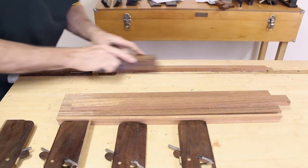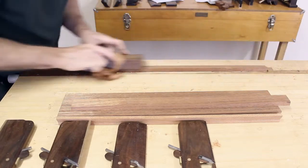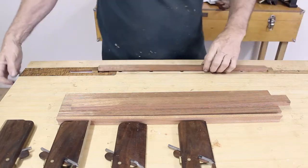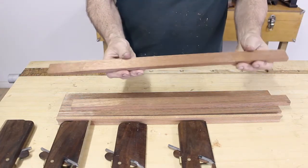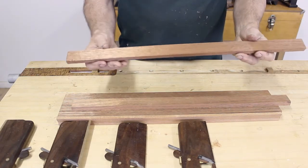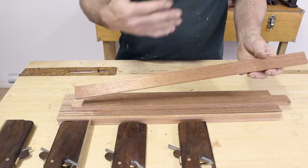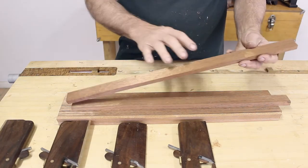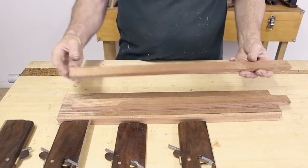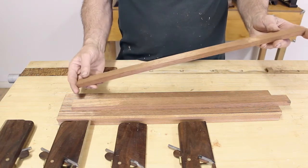This angle was 15 degrees. The other thing to consider is matching your timber — mouldings are about the mouldings, not about the timber. I definitely wouldn't use highly figured timber to make mouldings; it makes it difficult to make for a start, but it's all about the lines and shadows that are cast on the moulding, which gives your furniture that look that you're after.